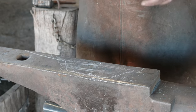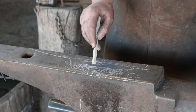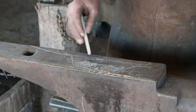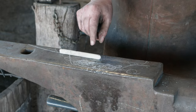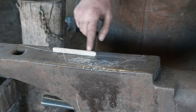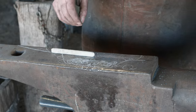As I work throughout the day, what's going to happen is I'm going to start getting clinker building up in the bottom of my fire. That clinker takes the place of fuel, which shifts all the zones of my fire up within the fire pot. So now I may be coming in at what was previously a neutral or reducing zone and instead be in the oxidizing zone, because that oxygen hasn't been consumed — it's all clinker down there. That's going to give me more scale, make my welding harder, and make it more likely that my piece of steel burns.